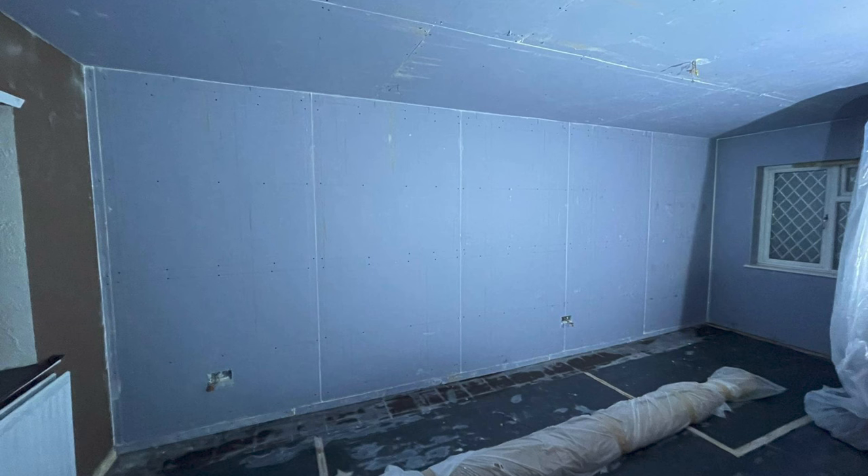This is the back of the property. For a lot of homeowners whose neighbours have put an extension on the rear, this is the original back of the house and the neighbours have a big extension with possibly an RSJ sitting close to the separating party wall. The homeowners here are hearing a lot of noise on this window wall as a result of the neighbour's new extension, which is why we've put a really good 50mm system on this window wall — which will offer an 80% reduction in noise here.